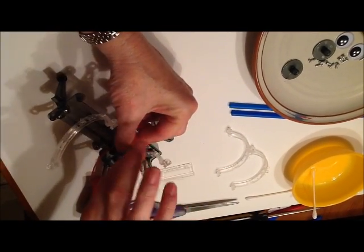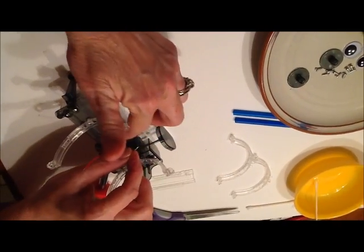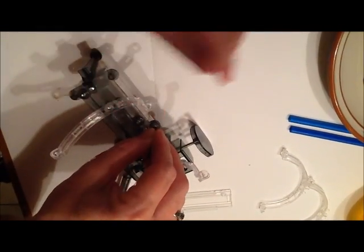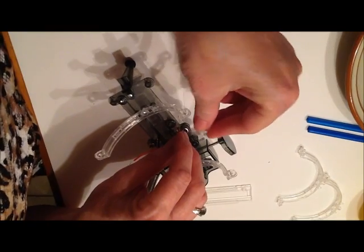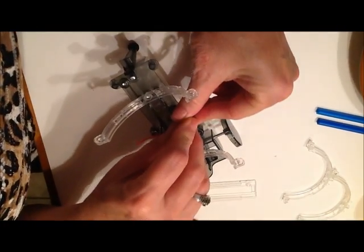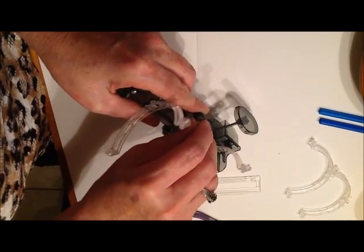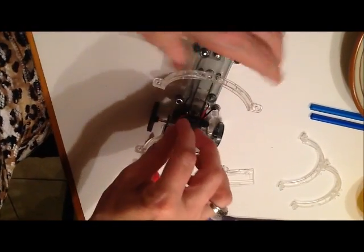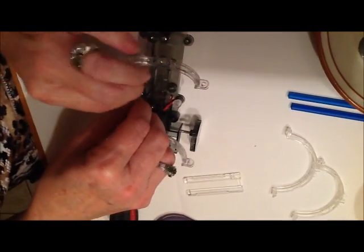and twist the wires a little bit. And then there's two holes right here, 1 and 2. You're going to put that down in there and then take one of the little caps and snap it down in there, and it holds the wire in there, and just push a little bit of pressure. It doesn't take much. And then do the other one exactly the same way.